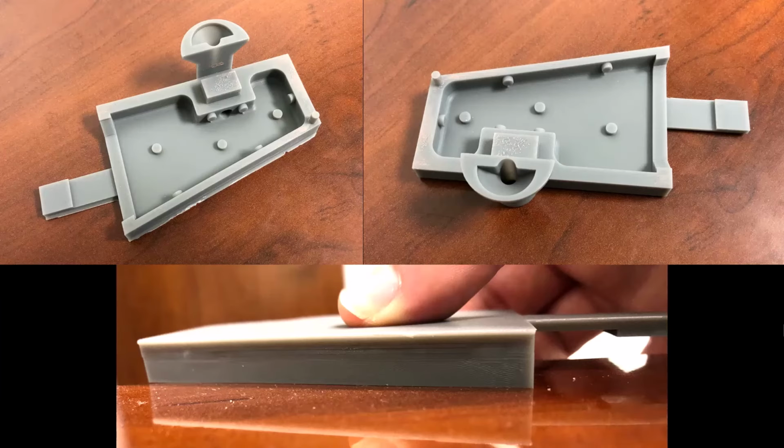So after the print job was done, we double checked the flatness. And you can see we have a lip there on the very bottom. That's just where, in the initial layers, the laser will oversaturate, overexpose the resin, and get a good adherence between the first couple layers and the build platform. So it elephant feet out. But because that surface is not a critical surface for this mold, it's not really a big deal. But it is one of the reasons why you want to be wary of printing directly on the build platform. Anyway, we checked the flatness of the surface. You can see right there on that table, and everything was perfectly what we expected. So we definitely took Formlabs' advice there.